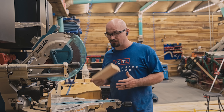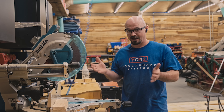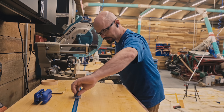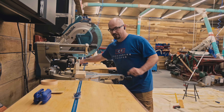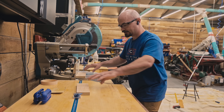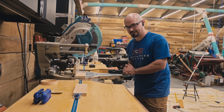A great way to minimize variance: if I only have one or two pieces, I'll mark in place and then cut them together — hold them flush so everything gets cut at once. If I have more than one cut's worth, that's where stop blocks come in. On my miter station I have tracks and little stop blocks I can set, so I only have to measure one time. I mark one piece in place, line it up, perfectly line up my blade, set my stop block, and then all my remaining pieces go against that stop block for consistent cuts.